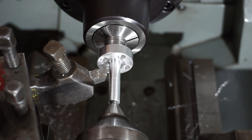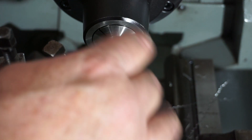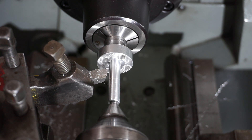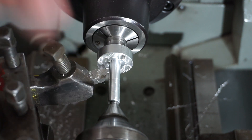I had to turn the camera off before because my tailstock was out — and it was out by a lot, about half a mil over the distance. I'm a little bit gobsmacked. I re-leveled the lathe and reset the tailstock with the tailstock alignment tool and I thought I had it spot on, but unless it's moved I've got no idea. Anyway, moving on — I adjusted the tailstock. I've been chasing my tail a little bit here; it's still a little bit oversized, so I'm going to take a cut now and auto feed in reverse.